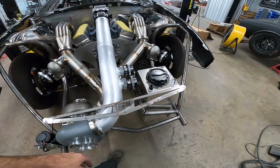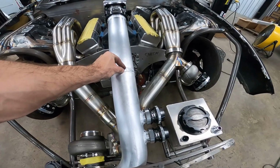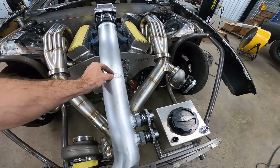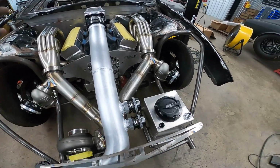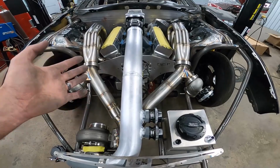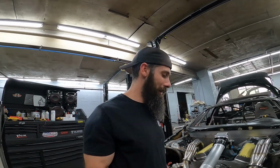This has turned into a tech tip video, but just things that I have experienced. When you tack the aluminum pipe up here, it don't matter how tight you have everything together. When you weld this joint, it's going to shrink. If you got 5 tacks, 10 tacks, whatever around there, when you weld it, it's going to pull it in just a little bit. So it is going to shorten your pipe. Your pipe always ends up being a little bit shorter than what you put it up there to be. That's why I usually clamp it together and get it fully mounted up, and try to tack it as many times as I can to try to prevent it. But with the dual seal connectors here, they really help to absorb any kind of gap you might have. They'll still seal off great, so they're a good choice to use.